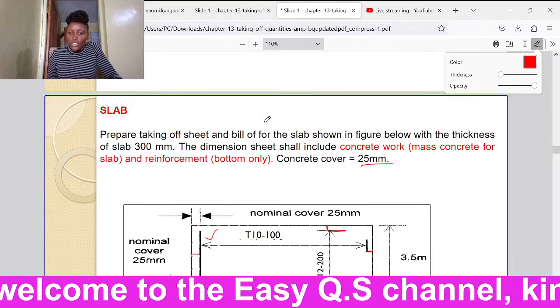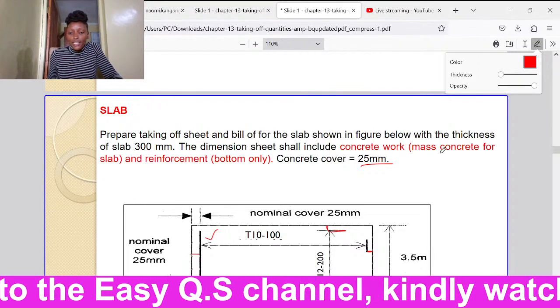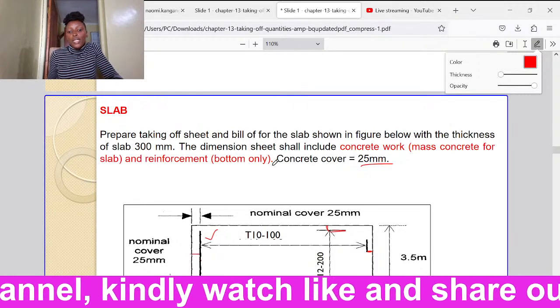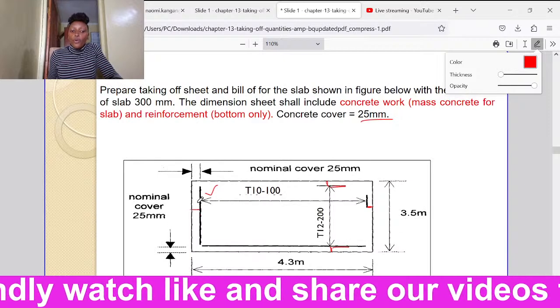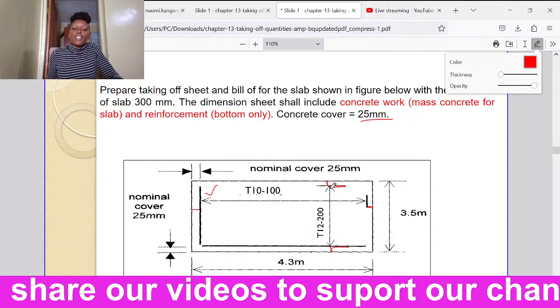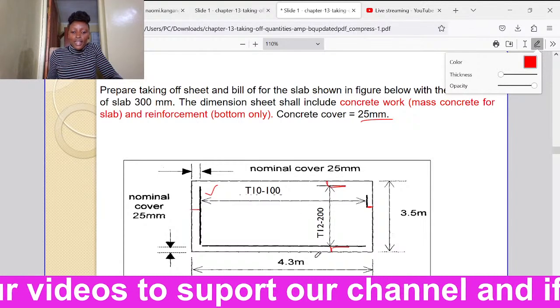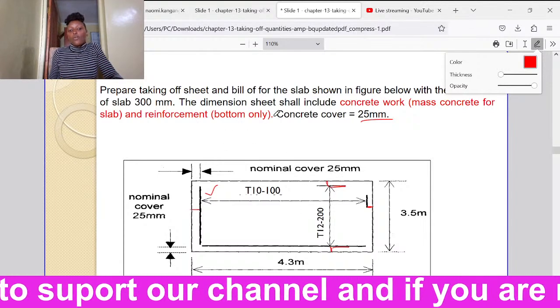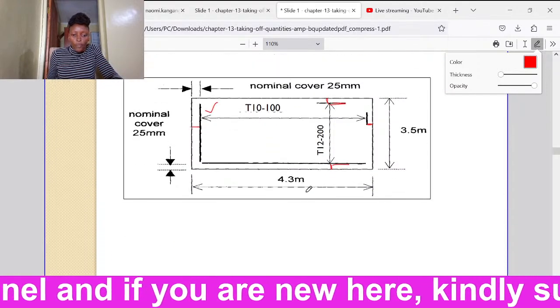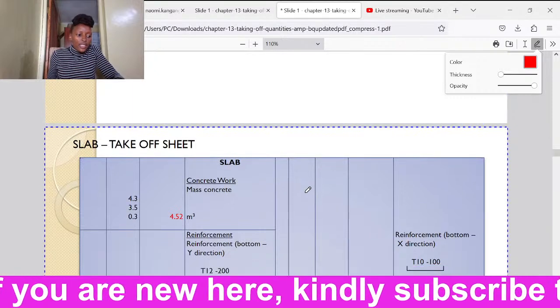The dimension sheet should include concrete work, that is mass concrete for the slab, and reinforcement for bottom only. So we are told to take off for bottom only. You know, in a slab, we usually have bars that go up to the end, then come back. We are told to take off only for the bottoms. So we'll only form the mesh at the bottom. So how will we go about it?